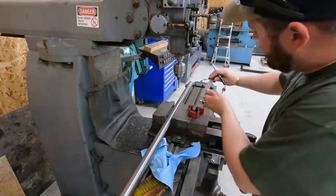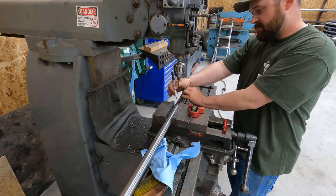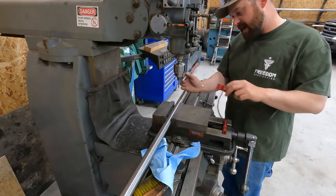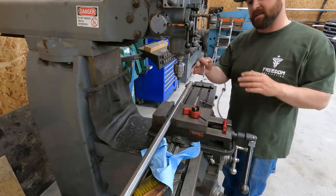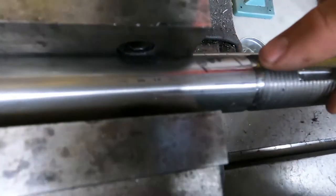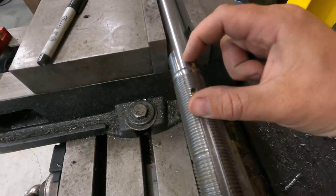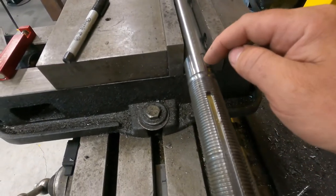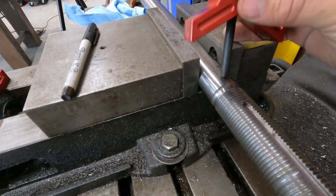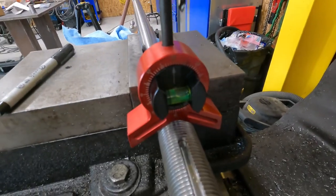Okay, so I'm just taking a steel ruler here, setting it in that keyway, making sure it's tight, marking it. Doing the other side and marking it. I'm going to take my centering head and mark dead center of that, then check it with the centering head to make sure this is square with the machine. I've marked this side and this side - I've got a little dimple there. Smacked it with a center punch. Okay, so then I take my centering head and put that right in my center punch dimple, set it up square. We're that far out, so we've got to adjust.